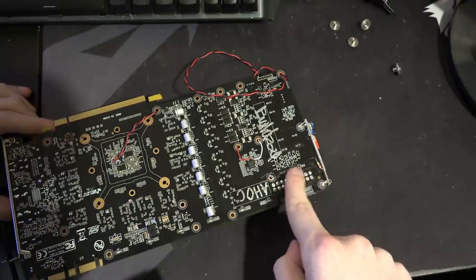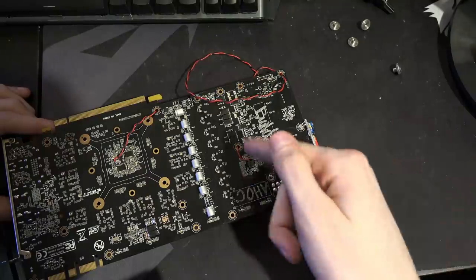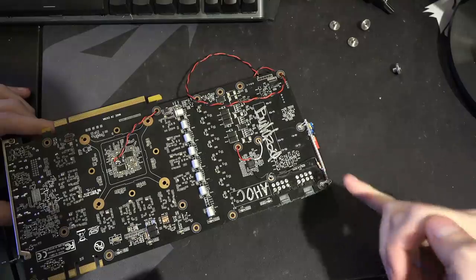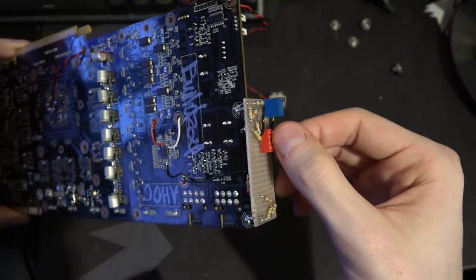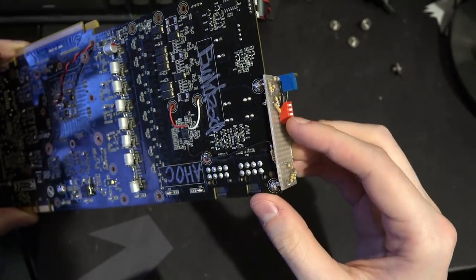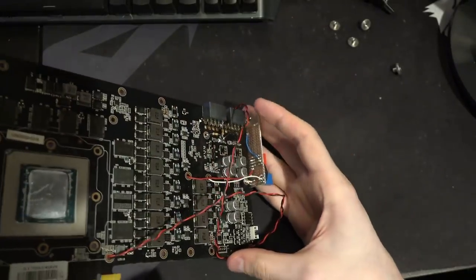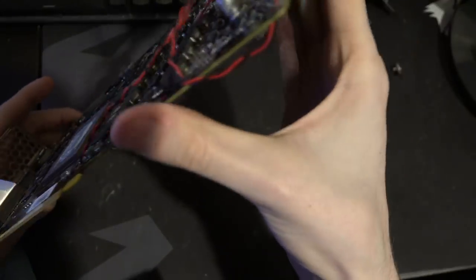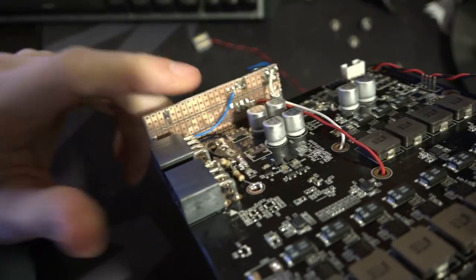That resistor and this black wire going along here goes to the switching frequency circuitry. Normally that would just have been a resistor to ground - now it's a wire going to a resistor, which goes to more resistors in parallel with the switches. It's really just a bunch of resistors in parallel and some in series to get the correct values - it looks complicated but it really isn't. There's also the power mod right there by the eight pins - the card doesn't know how much power it's pulling, so it can't power throttle.